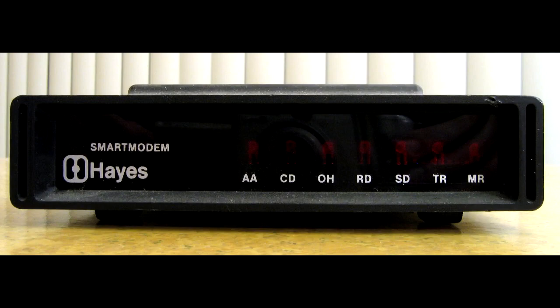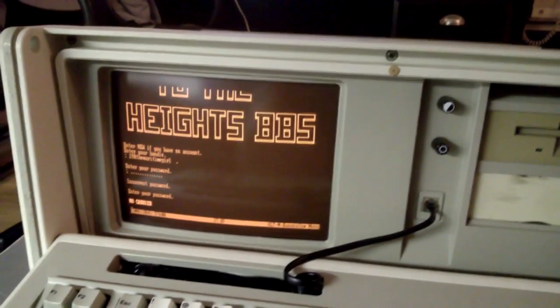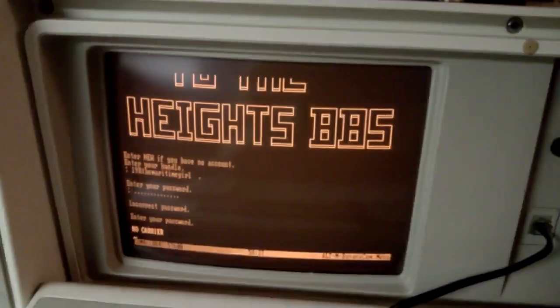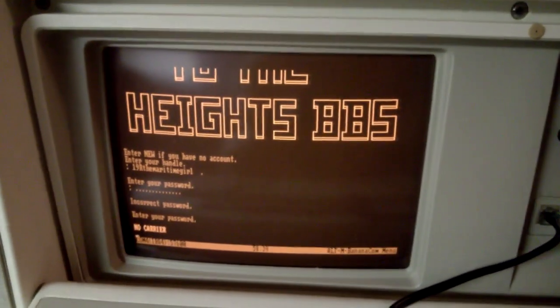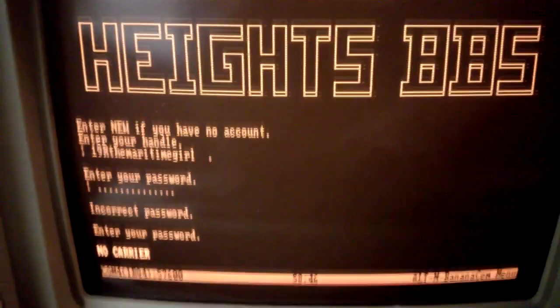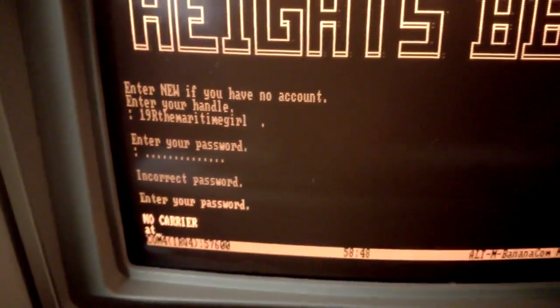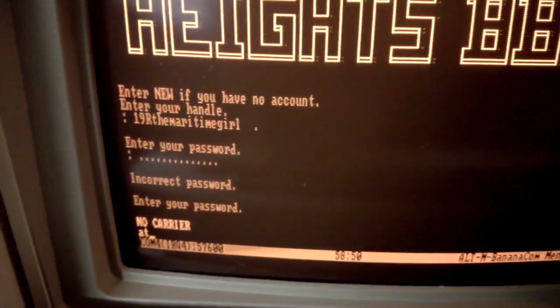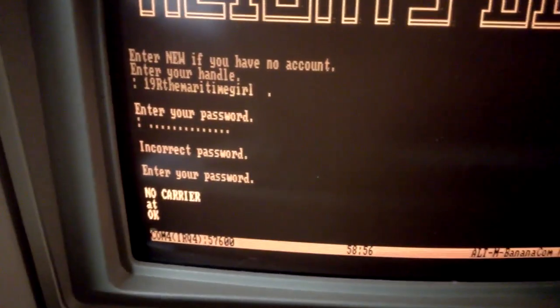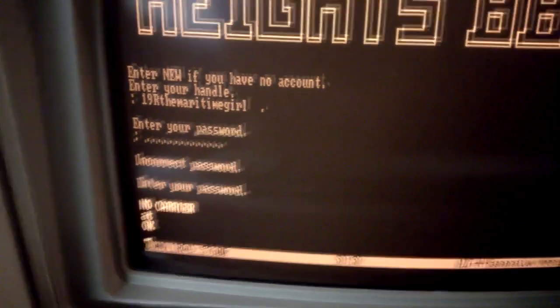And it established what would become the biggest standard for modem control, and it's called the Hayes command set. It's sometimes also called the AT command set because every command begins with the letters AT, which stands for attention. If you type AT on its own, it just prompts the modem to do a generic response, and it says OK. So AT is just a way to show that the modem is actually functioning.